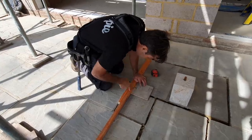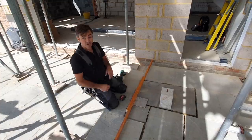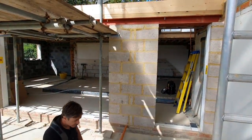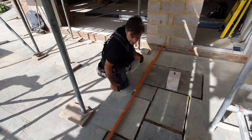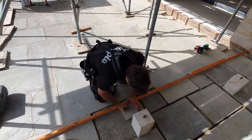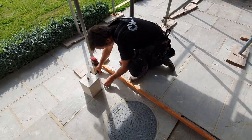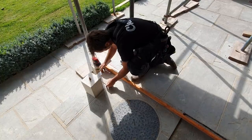What I'm doing here is creating this simple rod. I know that's the wall end over there — I'll put a big arrow on there and write 'wall'. I just need to allow for my bearing, which is basically going to hit the rim board. I'll let it go through the rim board so we can attach it all together. It will be built up off of this piece of block work there. I've marked my little square here — that's the centre of my post. I'll do the same here, and there's my rod.